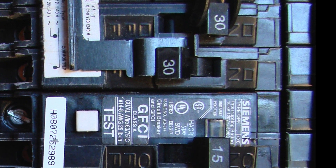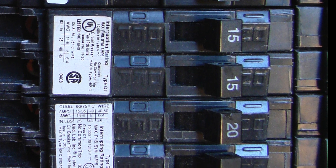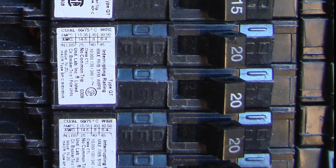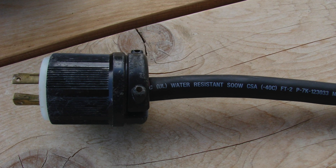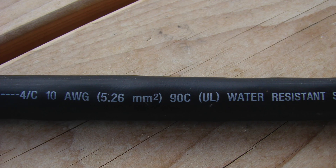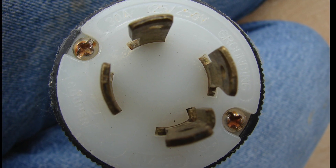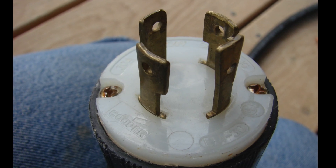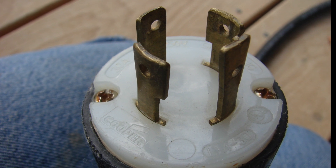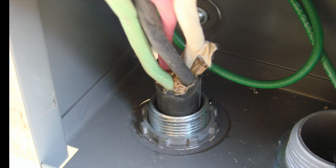This whole project should be done by an electrician, because electricians know best what has to be configured, what to look for, and how to do it right. We size the cord appropriately — this one is number 10 gauge wire, suitable for the 30-amp generator we're connecting. We're not going to have a separate extension cord; the cord plugs directly into the generator. When you're without power, the last thing you want is to search for the cord — this way it's already made up and ready.